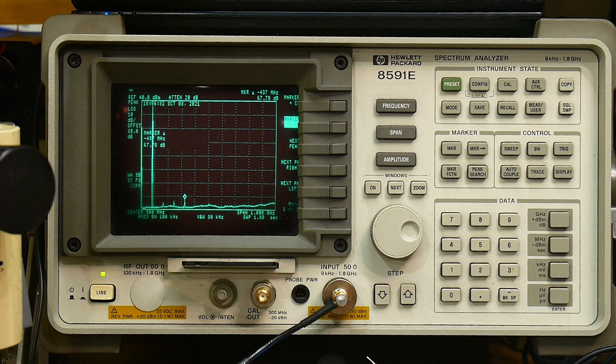So certainly in a relative fashion, this radio is passing with flying colors - greater than 60 dB of rejection. But for an absolute value in dBm, I'm not quite so sure. Maybe people can educate me on exactly what the new specification is. If I remember it right, it's minus 43 dBm, but that could be for a particular band, and different frequencies have different specifications. Anyway, it certainly is the best radio we've seen on this test equipment - the spurious harmonics are way, way down.